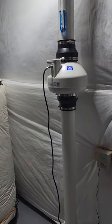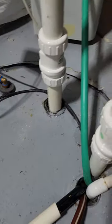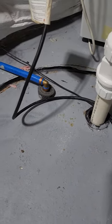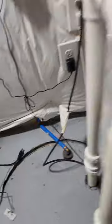I've got to get that removed — that's number one. Number two, that lid right there is supposed to be sealed along with all the penetration points. All the penetration points, as you can see, are wide open, so everything's got to be sealed up. And in Delaware, we also seal about 15 feet of the perimeter in either direction of the sump pit. As you can see here, none of that's done.